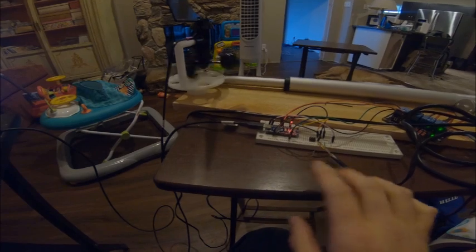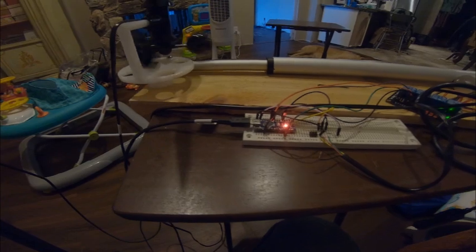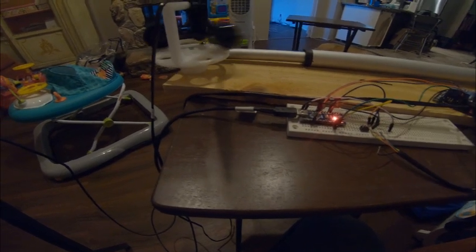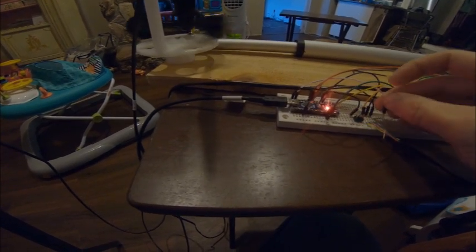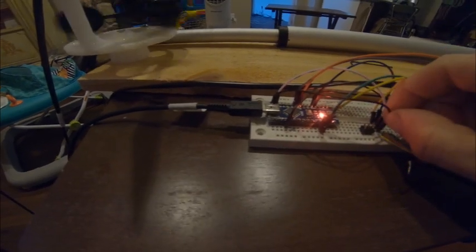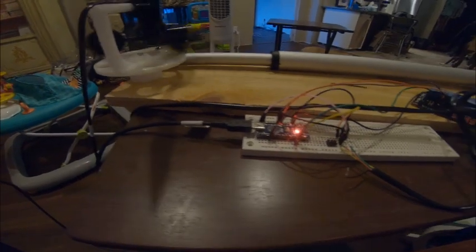Before I put the power on, I don't have any switches set up right now — I can't go buy any because we're all locked down. I have these two pins: pin 11 and pin 12 are my input pins for controlling and initializing the autopilot. Pin 12 is actually the autopilot on and off, so as I plug this in and out, the autopilot actually engages and disengages. Pin 11 is the set heading. Say you have the autopilot running, you disengage it, you want to change headings — you turn the boat to the new heading, you'll engage pin 11, then turn on the autopilot by engaging pin 12. These will be buttons on my tablet in the final version, but for right now for testing I'm just using jumper wires.